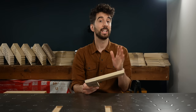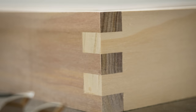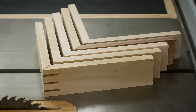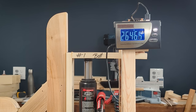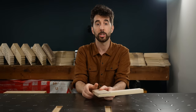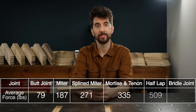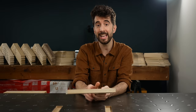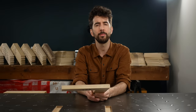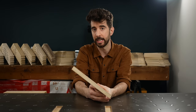As a quick aside before the results — you're probably thinking there are a lot of other joints out there like the dovetail, the rabbet, and the box joint. I made all those joints for situations like drawer boxes and wall cabinet cases, and I quickly found out that I couldn't break them the way I wanted — even a butt joint was already under a lot of pressure. So I concluded I would break the video in half instead of breaking more joints in half. As for the bridle joint: yes, it's strong! It came in at 542 pounds. But compared to the half lap, it's only just a little bit stronger. Compared to the mortise and tenon though, it's quite a bit stronger, even though they resemble each other — there's about twice as much surface area in the bridle joint as in the mortise and tenon I made.